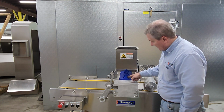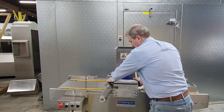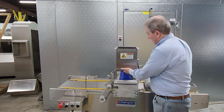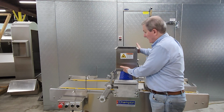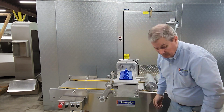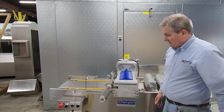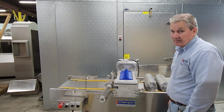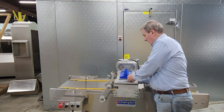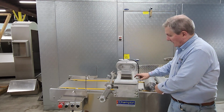This is the die holder, and this is the die, and this is the hopper. At this point, we would lift the die holder out of its locating pins and move it slightly back so that we can put one hand under here and one hand on the back side of the hopper and lift it off the machine. Again, this goes off to the pot and pan washer for cleaning. Once that's disassembled, the last two pieces in direct contact with dough are the hopper and the die holder. Because there's no power, you can lift this up and out easily, and then the die holder.